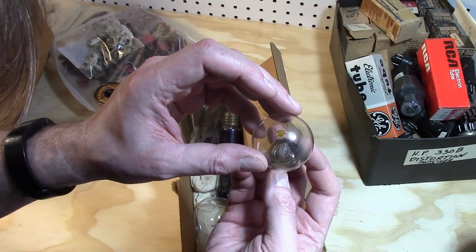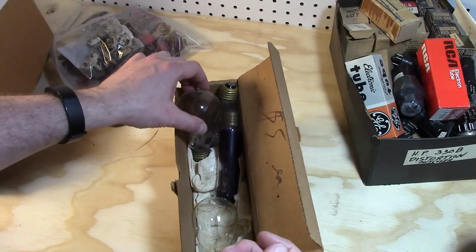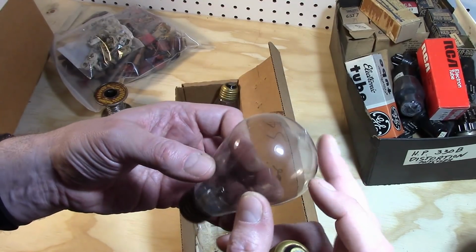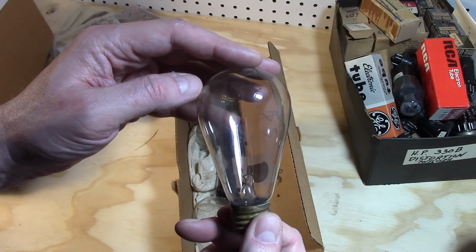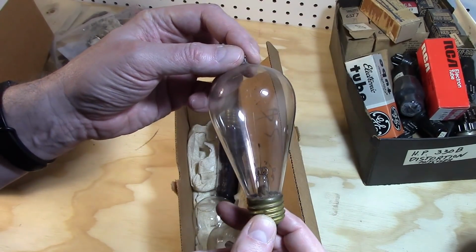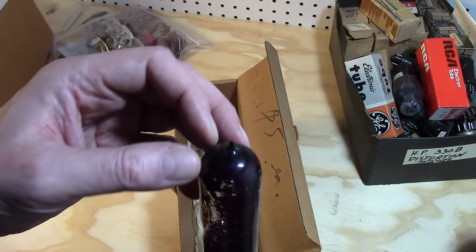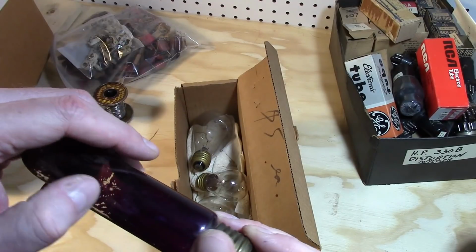And I can't read that. Oh, North America, 4CP115V, something like that. I don't know. And this guy, Zokul, ZOKUL. I must have thought that label was important because he put some Scotch tape over it so it wouldn't get lost. Don't think the tip has been broken on that. And the glass looks like it's hand blown or something. It's kind of ripply. And this guy, it's the same as that first one I pulled out. And this, which I'm guessing is an ultraviolet bulb with deteriorated coating. But I would think anything that's got an evacuate or seal off dimple like that is going to be pretty ancient. I don't see any bits of mercury in there though. The coating's on the outside, I think.